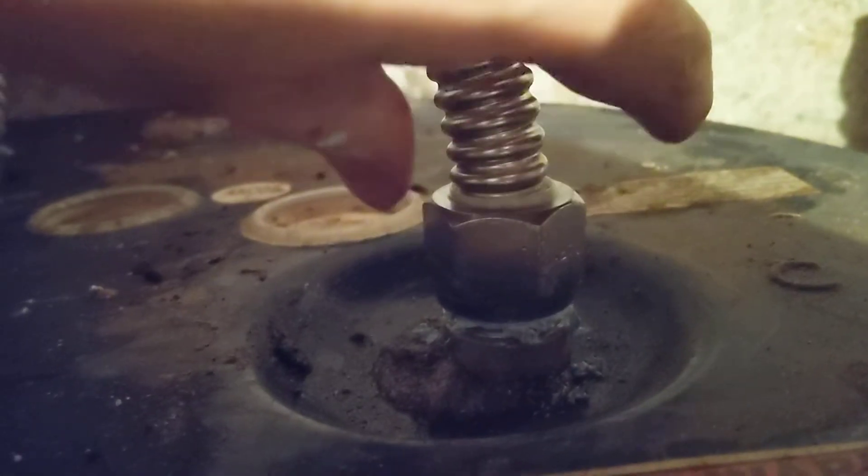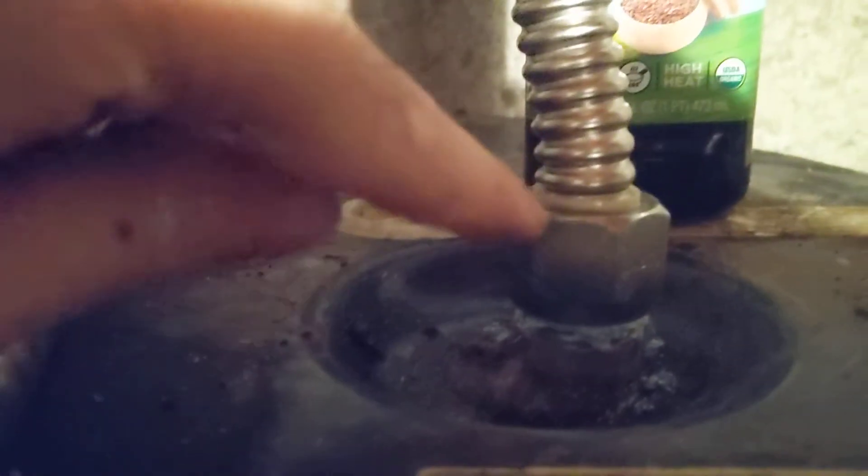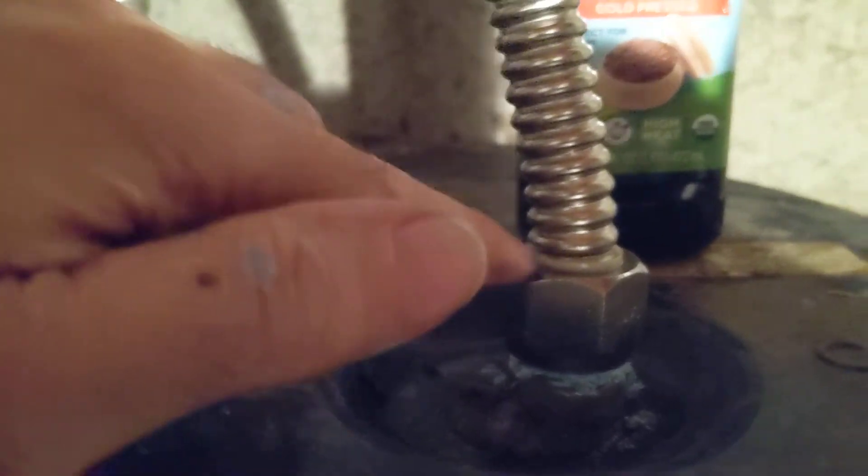Then this one — I don't feel comfortable ever bending near the attachment, the head, or the fixture, whatever you want to call it. Never really want to bend near these things. They also already looked a little bit liquid, but there are no drips. It's fully pressurized and has run a flow test. But whatever this liquid is, this is the flaxseed oil I put on it before I tightened it down — the oil I had on it when the head was floating free. It's also a good clue about what I'm working with. This fitting is probably a flare fitting with corrugated metal.